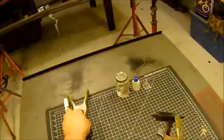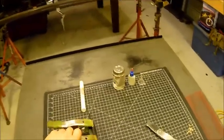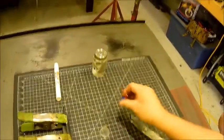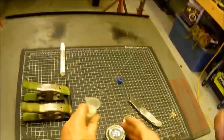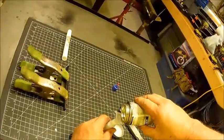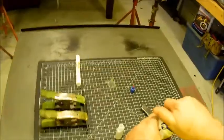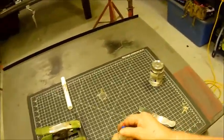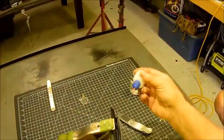This is for when you want to make a project box, just like I did the battery box for my bike. Basically what you're doing is solvent welding the plastic — you're not really gluing it. So we're going to get our syringe bottle. If you need to build a box, this is 3/16 ABS. Methylene chloride works on ABS, styrene, polycarbonate, acrylics — all that stuff. You're basically going to let it capillary in there.